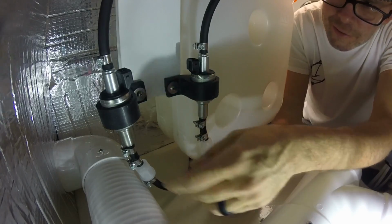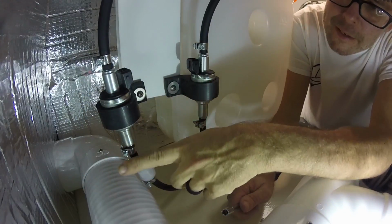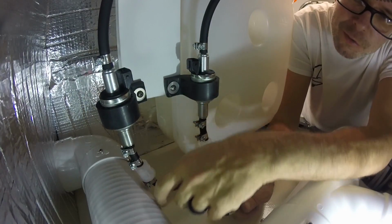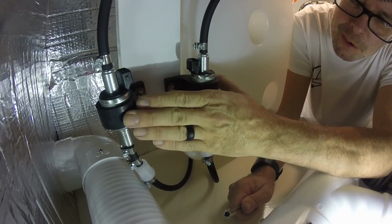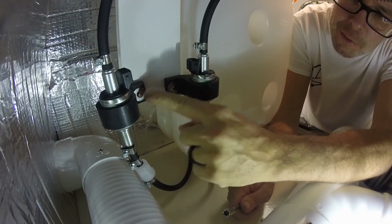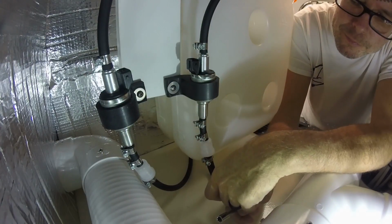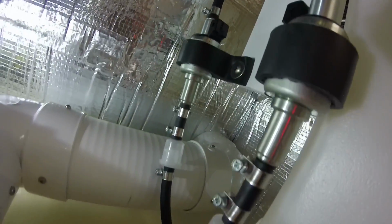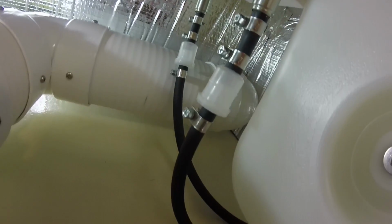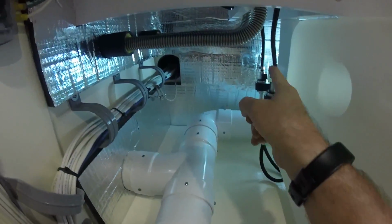There's no directions on the orientation to put these fuel pumps, but I did see on someone else's video they suggested tilting them 20 degrees. I'm going to fire them up, see how they do. If they have problems, it's real easy to loosen these two set screws and tilt them any orientation I want. Fuel lines are all in.